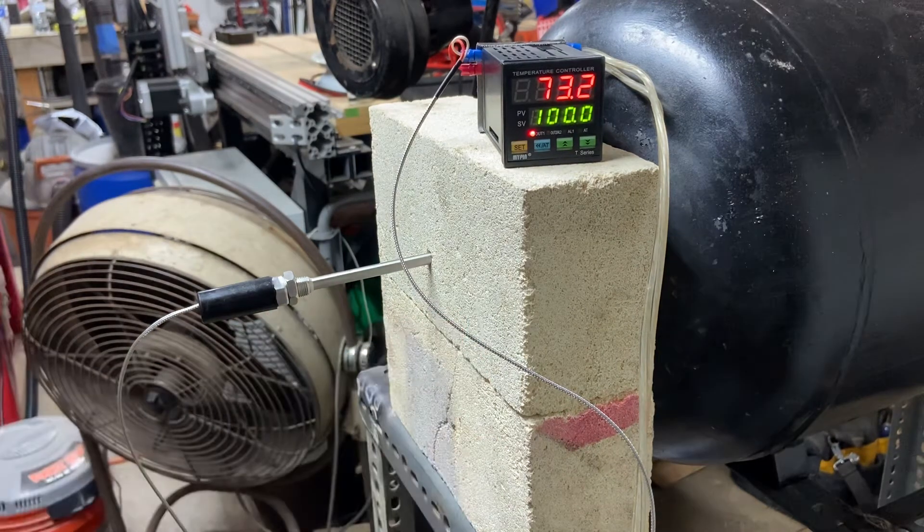In this case it's going into a forge that may see upwards of 2,400–2,500 degrees, so you need something that's going to hold up to that heat. That's either going to be a stainless steel tipped probe, or even better would probably be a ceramic sheathed thermocouple or ceramic thermocouple probe. For what I'm doing, stainless steel works just fine and they're typically a little bit cheaper.